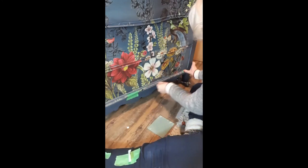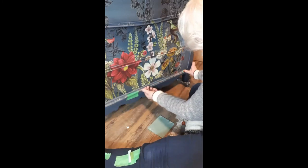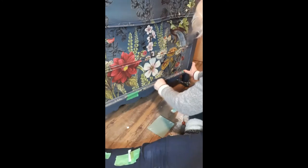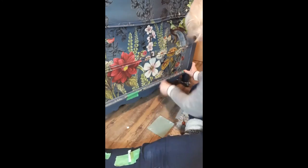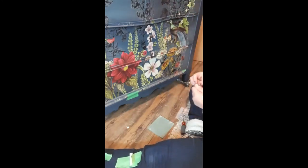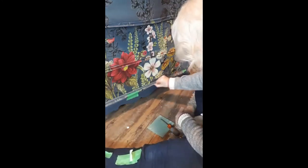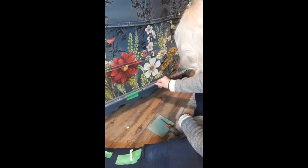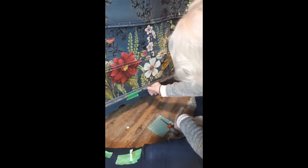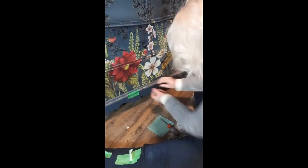I think it would be pretty nice as an entryway cabinet. If you were renovating a bathroom, you could do one like this for the bathroom, and then you would just seal this with a polycrylic top coat of some kind. Fusion Mineral Paint has a top coat, but I wouldn't use their top coat on this dark surface because it tends to streak. But I use wipe on poly, the Varathane wipe on poly, quite a bit for a dark sealant